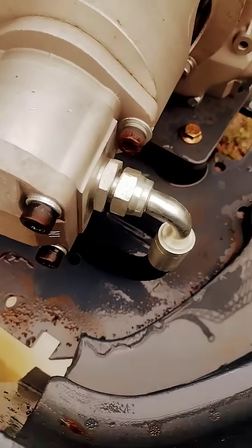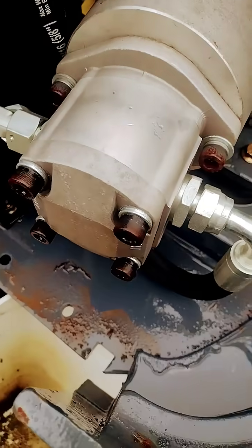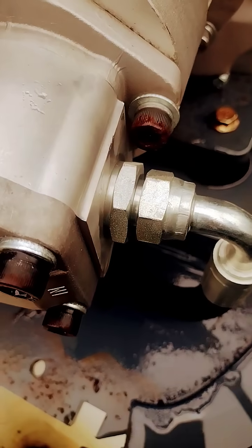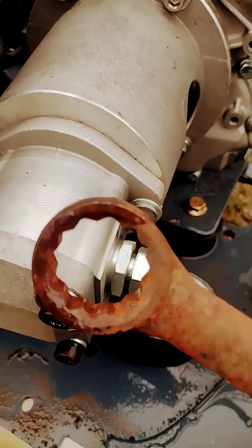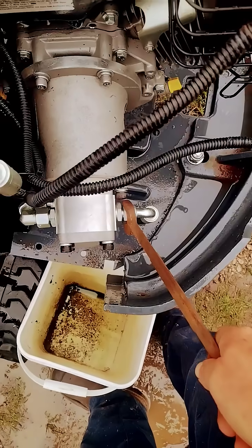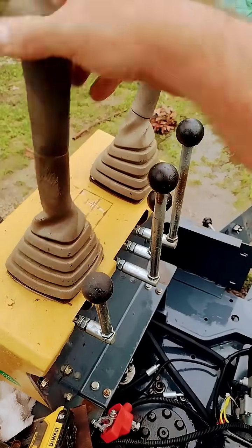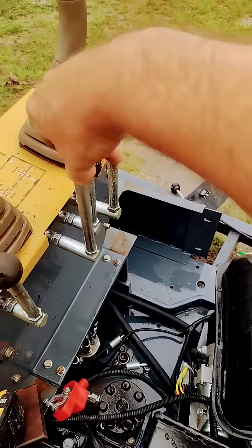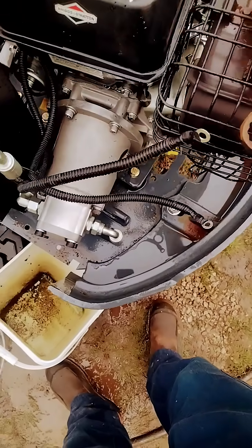In order to break this off without getting hydraulic oil all over the place, I'm gonna take this off and maybe bend this hose down over here into my old catch bucket. To break this fitting free you're going to need a 1 and 1/16 inch wrench — preferably not rusty like this one, but this one will work. Righty-tighty, lefty-loosey. Before I do that, I like to shake the controls — you don't want a lot of pressure in that line.